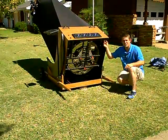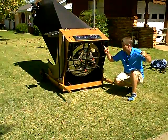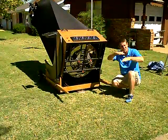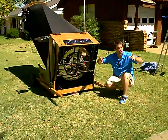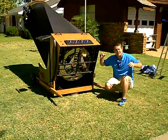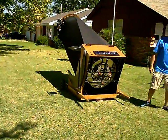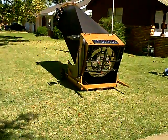The reason I do that — I'm the only one who does that — is it supports the mirror at its edge. Most people just fix those to two points that don't move. As soon as you move one of these collimation bolts, the edge of that mirror is no longer in that same plane. It basically bends the mirror and causes what's called astigmatism. With linear bearings, you adjust this, and the linear bearing will compensate for that movement, so you don't have that same astigmatism. That is by far the hardest part to build — the mirror cell.